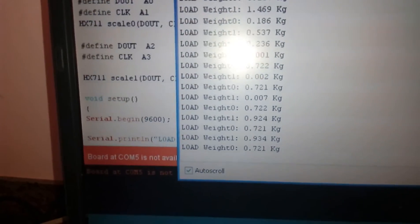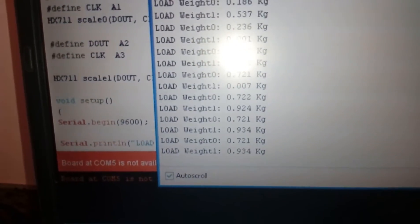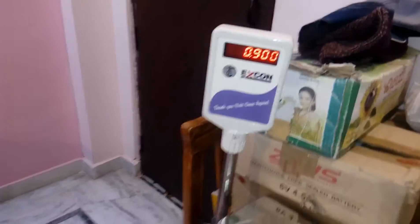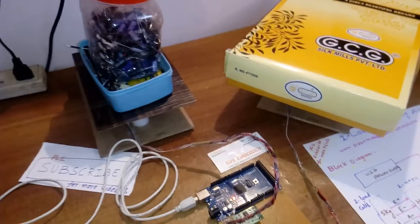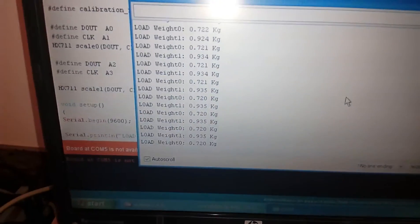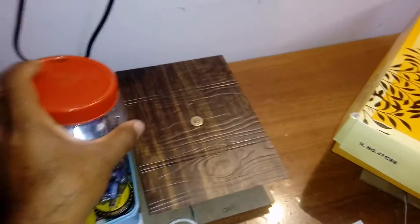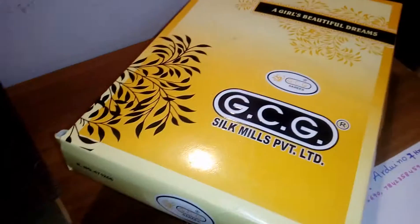Reading is 930, 924, 934 — plus or minus 5%. It is giving output in the form of zeros but we can make it exact. It can measure down to 0.001, which a regular weighing scale cannot measure. You can measure up to 5 kg individually — this reads 505 on a 5 kg load cell.